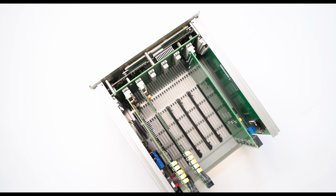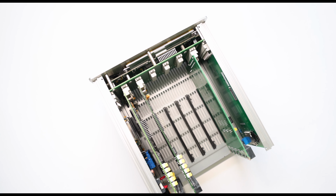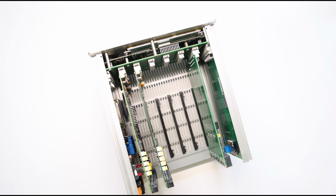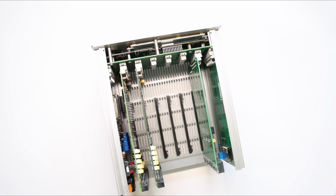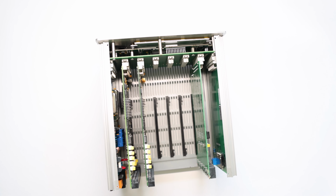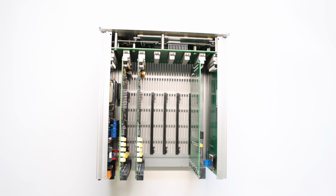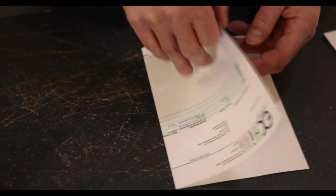The main is used when the flow computer is in normal operation, and the boot is used to hold the flow computer in a mode where the configuration is not loaded to allow firmware changes. The selection of which mode the flow computer is in is chosen via the bottom mode switch, but more on that later. So which version of firmware is installed in your flow computer?